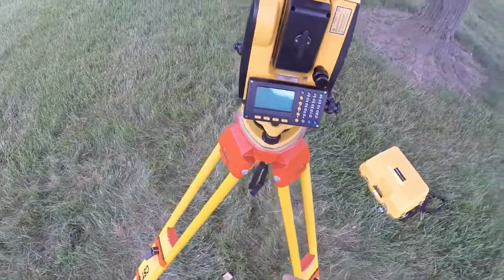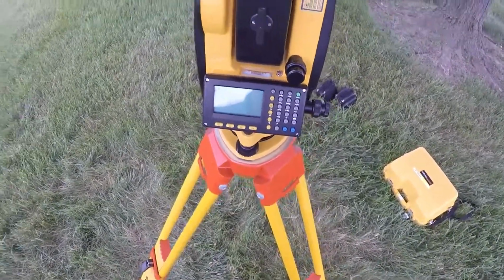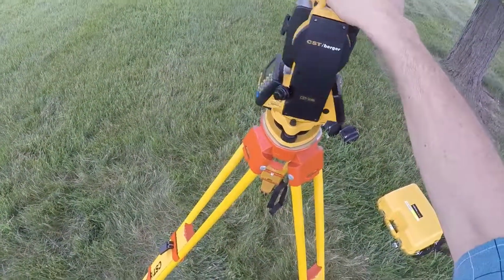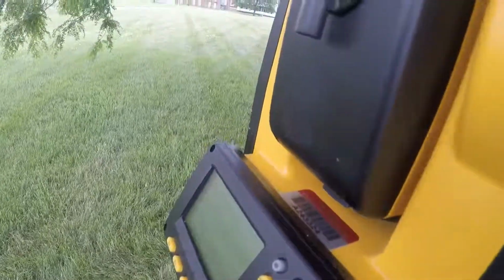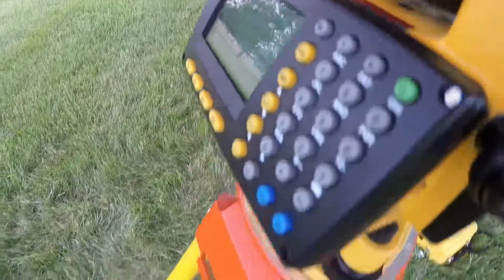the lines. So once you've been through the process of using your screws to get over the point, adjusting the legs to get your bullseye centered, and then leveling, the last thing you should do is double check. And if you're lucky, you'll be right on. In my case, I'm still off about a 1/16 of an inch. The center of my crosshair is right on the edge of my black dot.